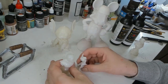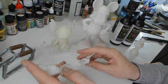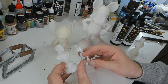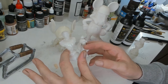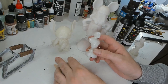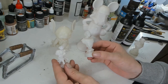There are two techniques that I used to use. One would be to lower the build plate, and another one is to just paint the parts with either epoxy resin, printer resin, or varnish. But each one of those has its drawbacks. There are pros and cons with each one. But one of the best ones that I found, which I used on this print and this print, was to lower the build plate while it's printing.